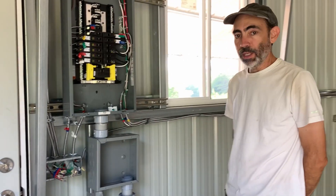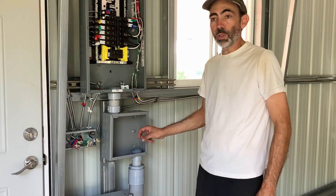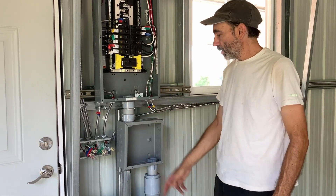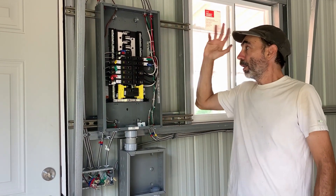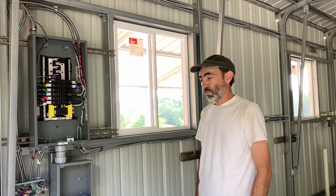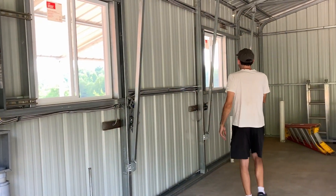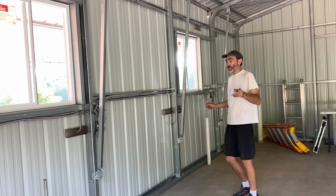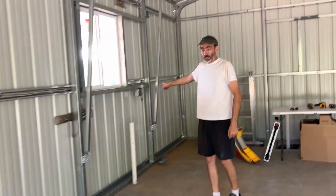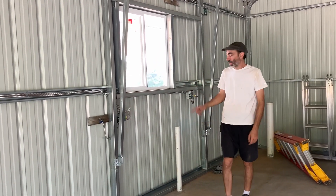It all starts with the feed in from the house - that would be this pipe going up into here. The reason it's coming into a box is because we also have the generator that's going to come back down into the house, so there's this box for that. The in comes up and into the sub-panel, and we have our breakers for all of the lines. On the left wall inside: this plug, these two plugs, and on a dedicated breaker, this single plug which will be for the Harvest Right. And then on a separate breaker is this one - you have to have a plug within three feet of a sink, and that's where the sink will be.